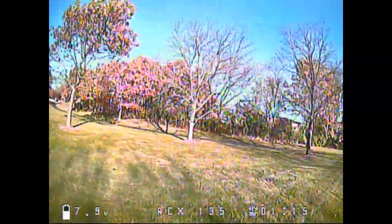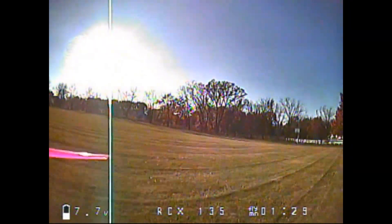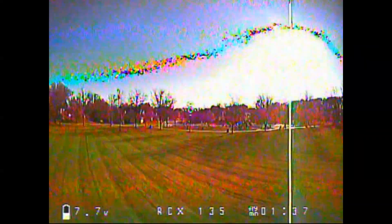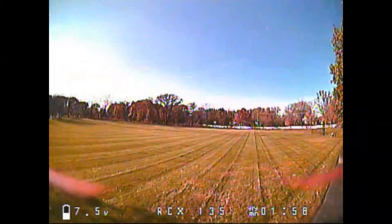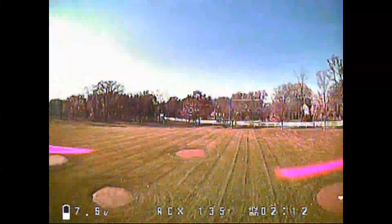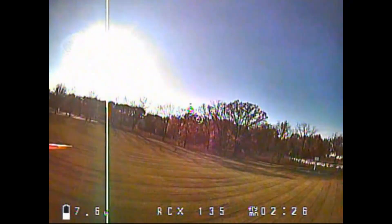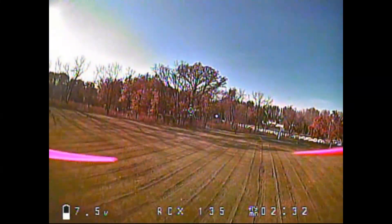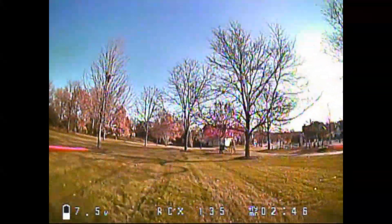The VTX from RunCam I was not quite as happy with. It really makes a clean build when it connects to the back of the camera, but when I'd get out anywhere from 70 to 130 meters, it would start to break up the video, and I was afraid I'd have to land if I didn't come back closer. Part of that is going through four or five trees, but it only has about a 100-meter range. Also, having the VTX mounted onto the camera makes that assembly a little longer, so you have to use the front mounting holes, which means the camera lens sticks out by about an eighth of an inch — there's a chance you could damage it if you hit something. If you mounted the VTX elsewhere on the quad, you could use the rear mounting holes and the frame would protect the camera.